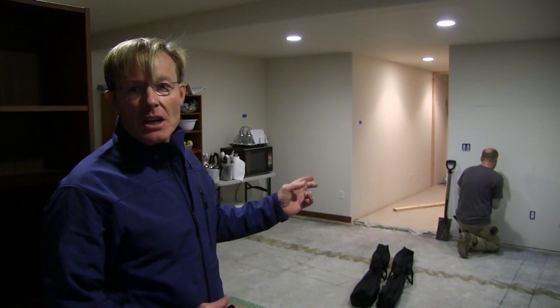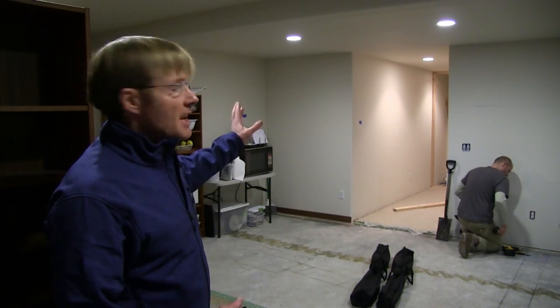Today's task — we've gotten started, we've pulled up carpet where we're going to be cutting concrete. Now we're ready to put up a dust wall before we start cutting drywall and making dust. This wall is going to stay in place for the length of the entire job until we're ready to clean up. I'm going to take a couple of minutes and show you how we do that.